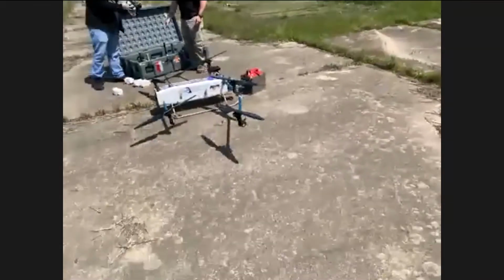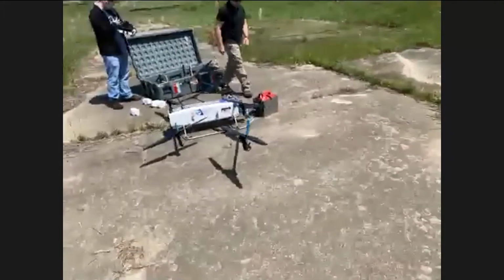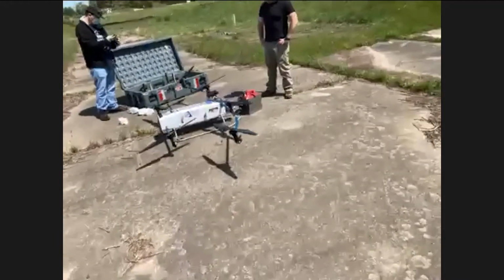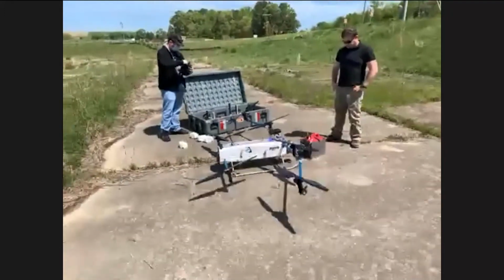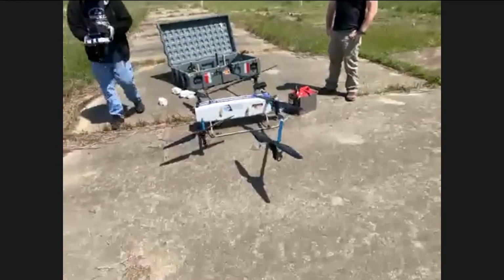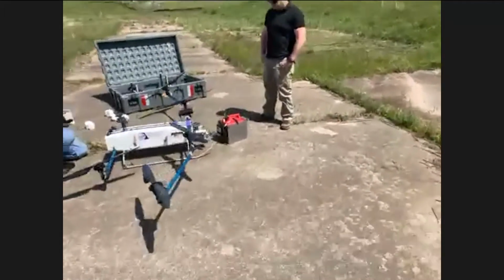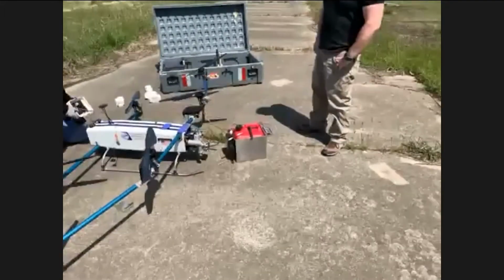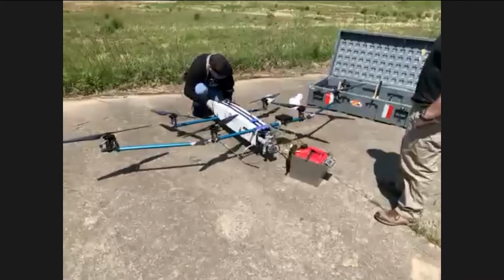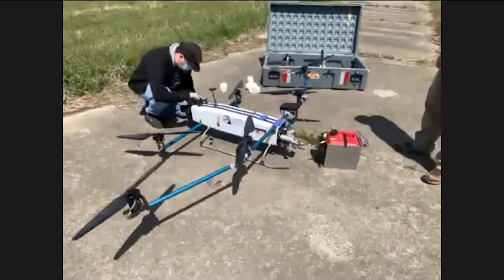And so you've got to bring a generator, like something you buy from Home Depot, for example, to run battery chargers. And you need at least 3 battery chargers, because usually it takes 3 times longer to recharge a battery than to use a battery in flight. And by the way, you normally need about 6 gallons of gasoline to run that generator all day long. To fly this aircraft all day, this is a 2-gallon jerry can in our fueling station. And so we actually burn about 1/3 of the gasoline as the battery-powered multi-rotor we replace. So there's actually an environmental benefit to the technology as well.